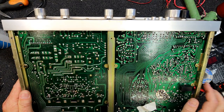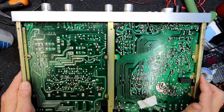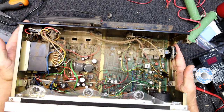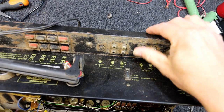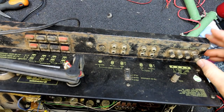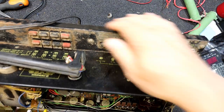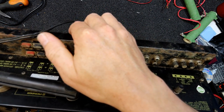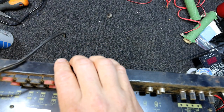There's a nice dry looking joint there, but it's only just half-way cracked around I think. That's in as good a condition as you can expect. It's often the case with these things — sometimes they look absolutely terrible on the outside. These speaker terminals are going to be interesting. I think I'd better take that out and get the dust out of those. We've got a voltage selector — is this one of those ones with a fuse in the middle of it? I might check that fuse.